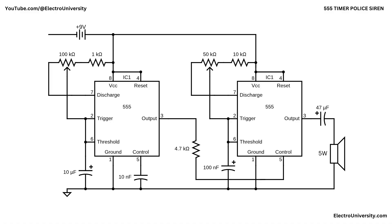The characteristic police siren effect comes from the 4.7-kilohm resistor connecting pin 3 of the first 555 to pin 5 of the second 555. Pin 5 sets the internal reference levels for the second timer's thresholds, so when the slow square wave from the first 555 is fed into this pin through the 4.7-kilohm resistor, it gently shifts those internal levels up and down. As these reference points move, the effective charge and discharge thresholds of the 100-nanofarad timing capacitor change, causing the oscillation frequency of the second 555 to rise and fall. Instead of a fixed tone, the pitch now continuously sweeps in sync with the low-frequency waveform from the first 555, creating the familiar wee-woo siren sound. The first potentiometer controls how fast this sweep happens, while the second potentiometer sets the base pitch and overall range of the siren.